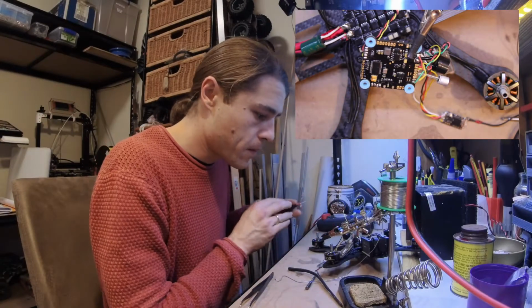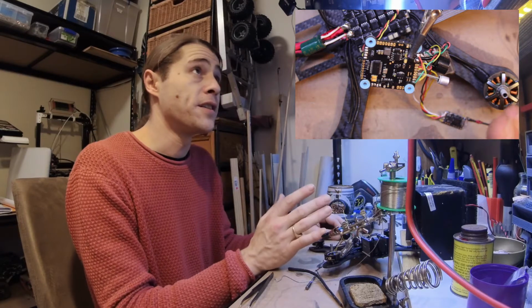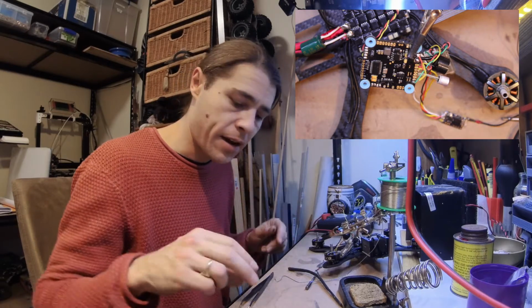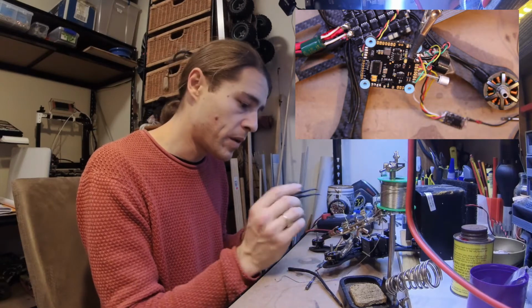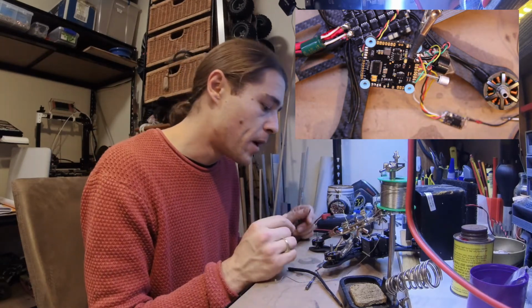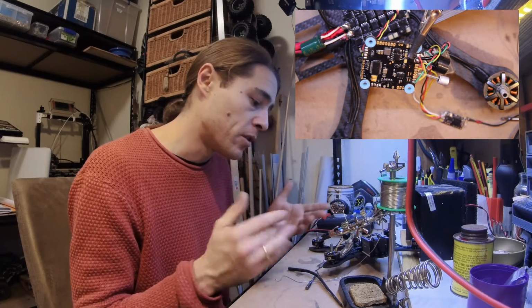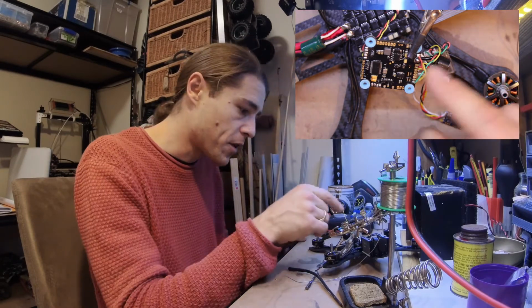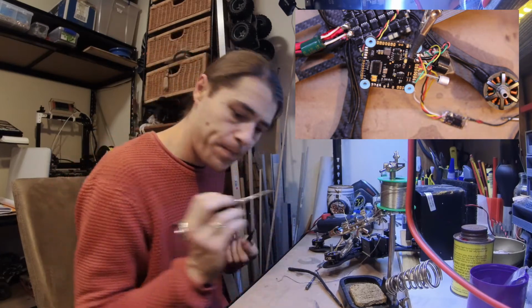Yep. Okay, cool. So you've got to be really careful. That was basically unseeable even for me. But you know, the machinery said there's something wrong. Check it out. And just by feeling it out with the tip of these tweezers, I was able to definitely tell it was a piece of wire and not a piece of conformal coating that had lifted up and formed an edge. It looked like a wire or something like that. It was definitely wire, definitely causing a short. So now I've just got to reattach my camera line.